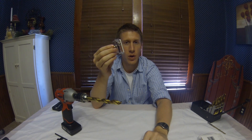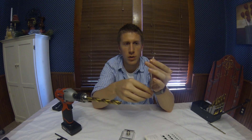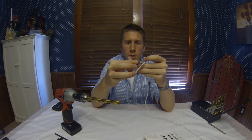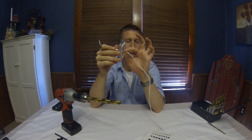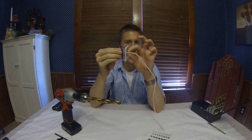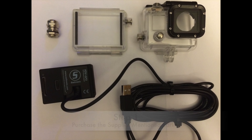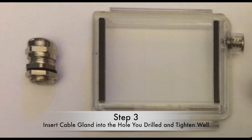You're going to maintain a watertight seal. The battery eliminator is going to have a cable and we're going to actually have to cut the cable and run it through. So here's a cut USB cable — we're going to have to cut that cable, run it through, and then re-splice it. I'd splice it on the inside — that's what I would do — so that the splice is inside the housing. The reason for that is you're compromising the integrity of the cable, so make sure it's inside the waterproof housing just to add to the waterproof factor.